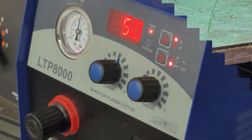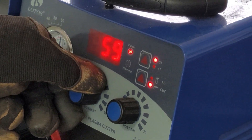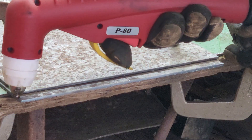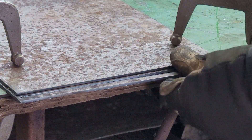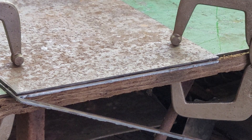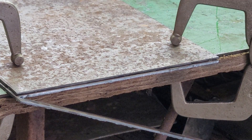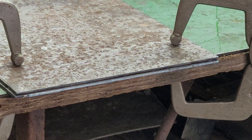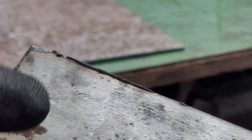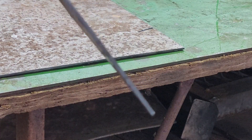We went up to 50 amps and did a fast cut. It cut right off and that thing is clean — there's a little bit of dross, but man that is really pretty clean. Look at that cut, guys. I know it's not laser cut, but that's a pretty nice cut. That's a full quarter inch.